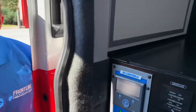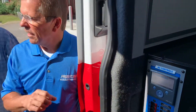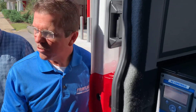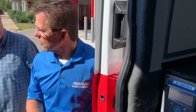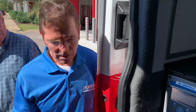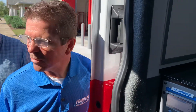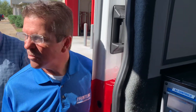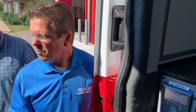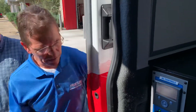My suggestion is to have it on charger only. If you're going to park it and you want to keep the truck energized, have it on charger only. That way, if somebody inadvertently unplugs it, you don't kill the batteries. You can draw those batteries down two or three times and they'll last for years — three to five years if you take good care of them. If you draw them down below 10 volts two or three times, you're not going to bring them back up.